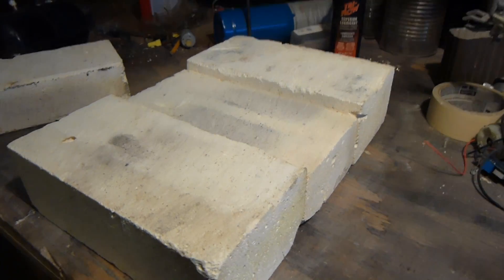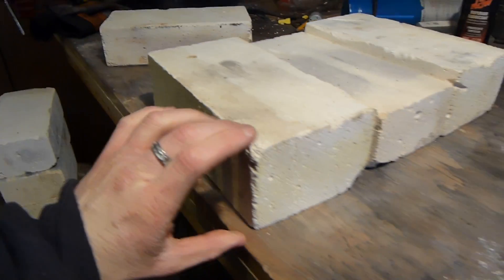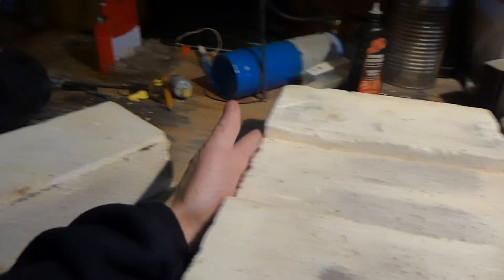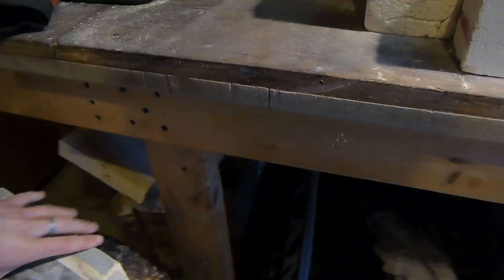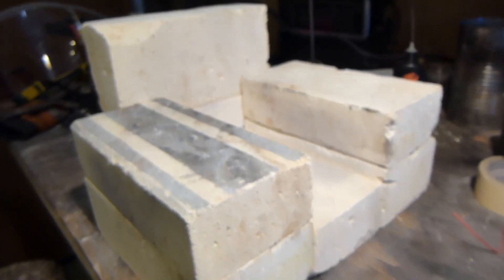My firebox is pretty temporary — it's just a bunch of fire bricks or furnace bricks. These are extremely light and really good insulators, about four and a half inches wide. I have three-inch and two-and-a-half-inch thick ones. I have a two-and-a-half-inch one in the middle, two three-inch ones on the ends, and another block on the end. That's the firebox, and the boiler just sits right on top.